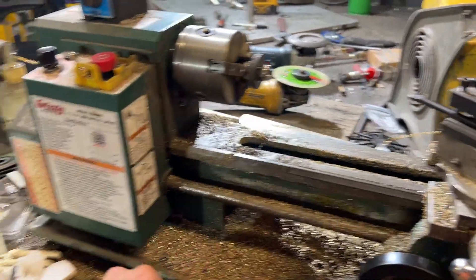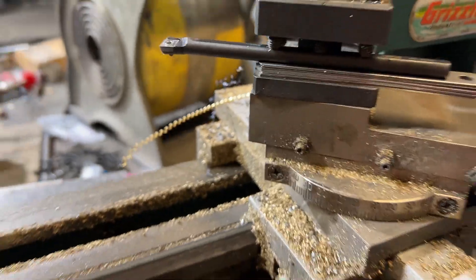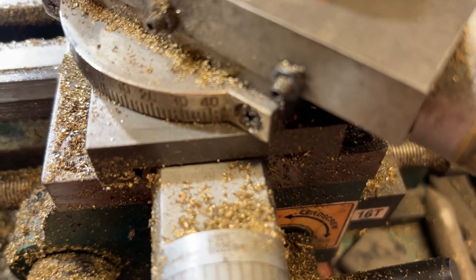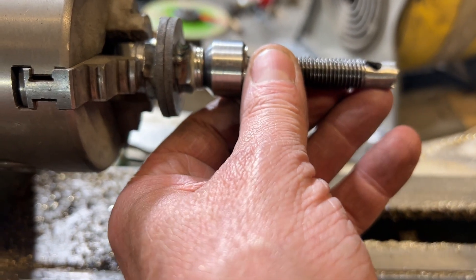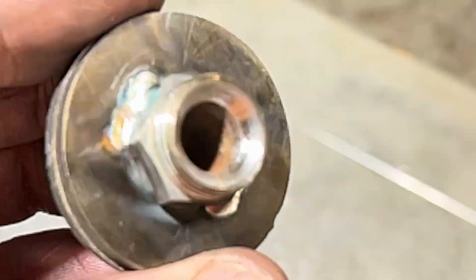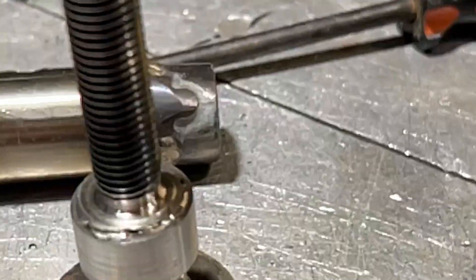Sorry for being so boring and not showing you guys what I'm actually doing. I had to seat this valve, and man, was that tough to do. The arrangement I had to go with — I had to stack this thing up. This will only go to like 42 degrees, and this is a 45 degree angle, so we've got kind of an approximate seat. But it appears to be doing good. This is the valve open. This is the valve closed. That's our homemade valve seat there. Seems to be doing pretty good. Fits in there nicely.